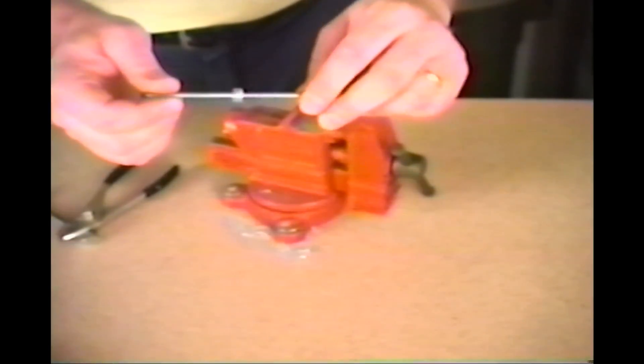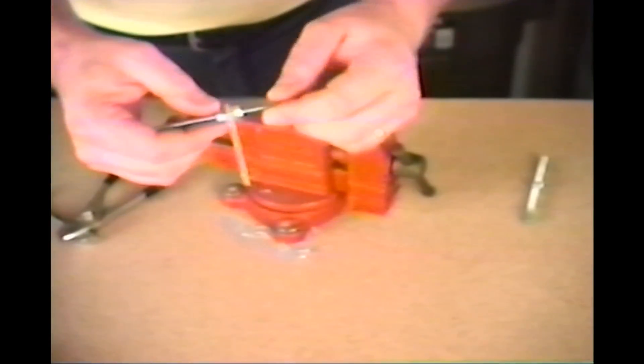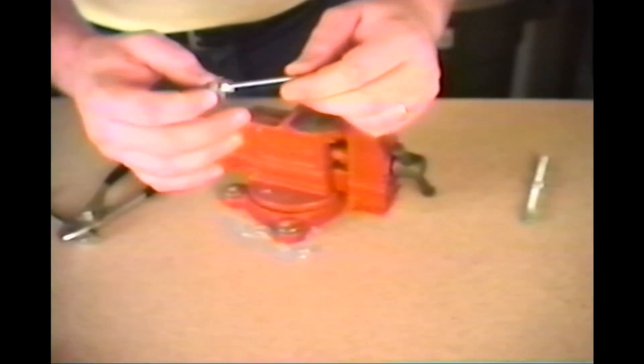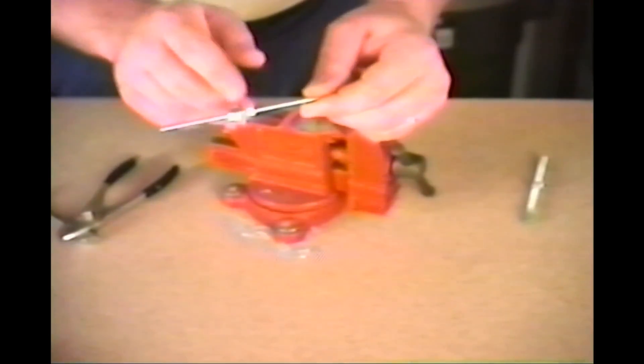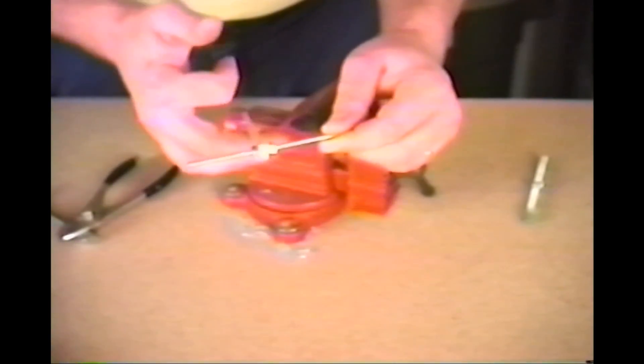This might not seem like much but it comes in very helpful in a case where you have a piece in your mechanics that will be moving a lot and you don't want the movement to cause the nuts to come apart. You simply turn the nuts in and lock them together and leave the space between the two locked-together nuts as the gap for your bar stock. This way the constant movement of the bar stock will not cause the nuts to become loose.